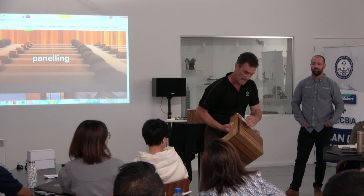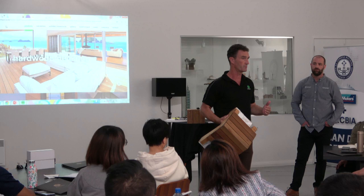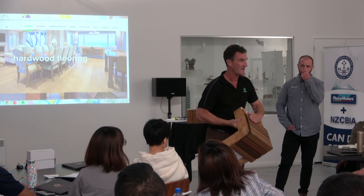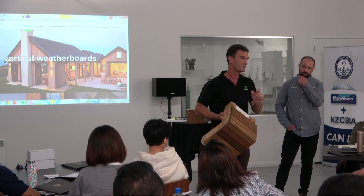And when you put that in, I'd probably use the crown head nails. It's a bit easier for your builders to use. A lot of people just go to the rose head nails, but the crown head nails have a little flat head on the top, and it's a lot easier for the builder to use. You get less slippage. What I would do with nailing, I'd get a little template of some plastic or some plywood, maybe 2 or 3 mils thick, and just slide it up underneath and then hammer away.